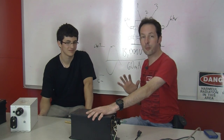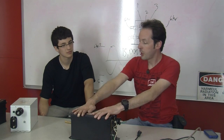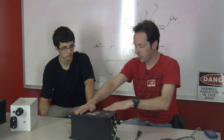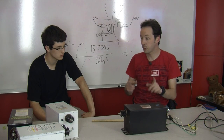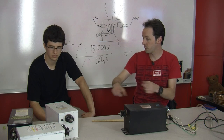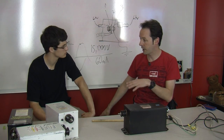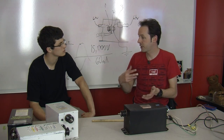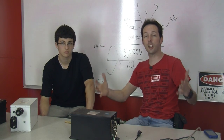But yeah, that's the basics for neon sign transformers. And for this coil project, we're going to loan you this one to build your coil and get it going. So we're going to help you out with that. Because this one doesn't have GFCI, which makes it easier. We'll keep an extra one through the process because they're interchangeable. You can just swap it out. And as we build this, we'll use a GFCI one in it so that we can show people the problems and the differences and how to surmount that and all that jazz. So that's this week's video.